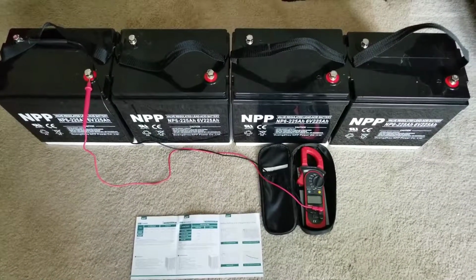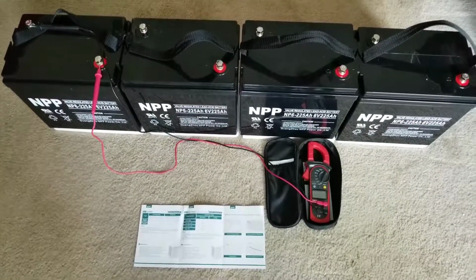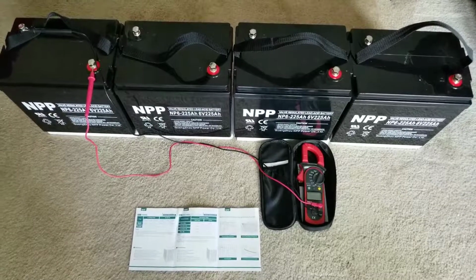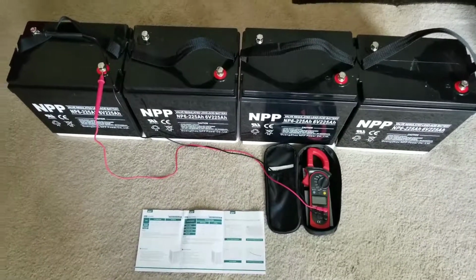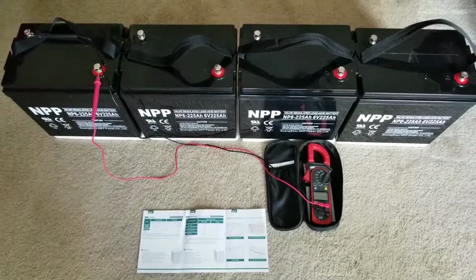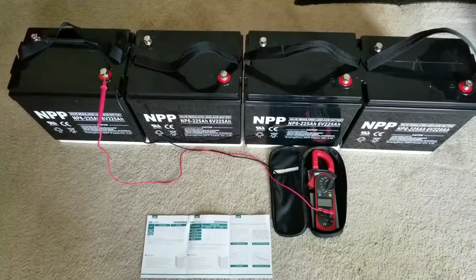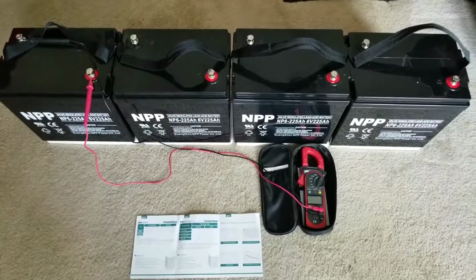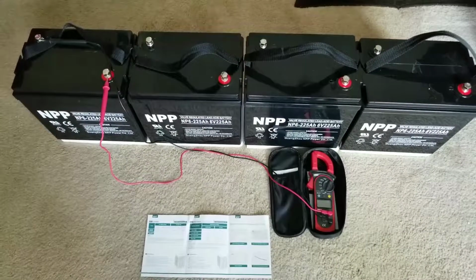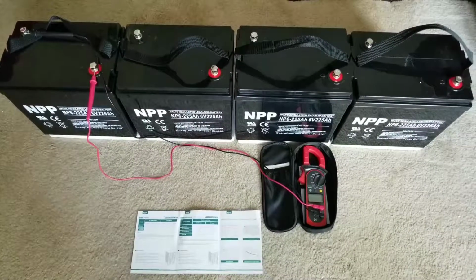I can transition one of the systems to 48 volts, and one is gonna be 24 volts. Some of you guys will say, why didn't you just do all the same so that you can have 48 volts and be able to downgrade to 24 volt. That's a good idea too. But I'm gonna end up having 16 batteries of this. It's gonna be a big box. I'm trying just to eliminate that. I don't want to have too much. I can still have 4 batteries on the 48 volt. I can still run it. 180 amp hours. I can split the load. So I'm able to do videos for you guys and see how the 24 volt and 48 volt run on the same batteries and the controllers as well.